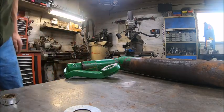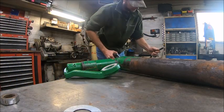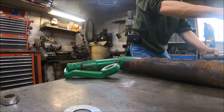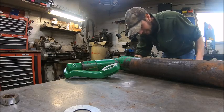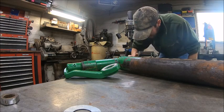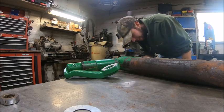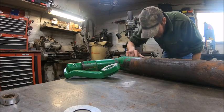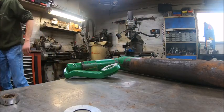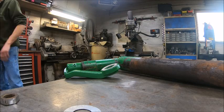It's kind of pitted. I probably ought to put a little something on there, just because, I don't know. It doesn't seem right putting this together without some form of something. Grease is better than anti-seize. Anti-seize is bad. You really do not want to put anti-seize on a tapered fit anything, because you will not get that shit back apart because it slides so easy.